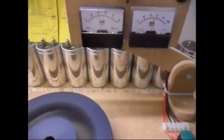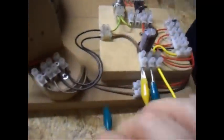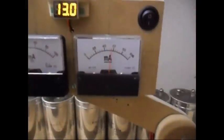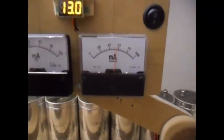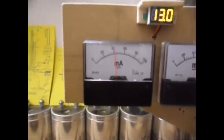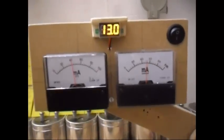Some of you may say: why not just make a motor that runs on 10 mA? That's not the point here. The point is how much power can we send back — how much power can we recover while the system is still running. If I take it off now, the neon comes on, still at the same speed, what is going back is zero, and the mA went up to 55 mA at 13 volts. Putting it back on — same speed — now I'm sending back just over 40 mA from the back EMF side, and the input is just over 50 mA. So the ratio is still the same.